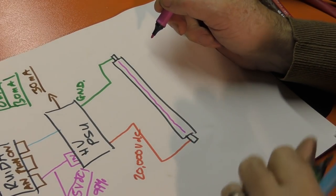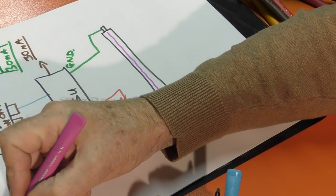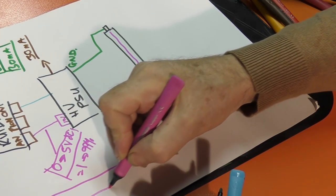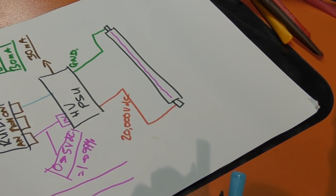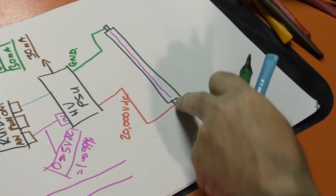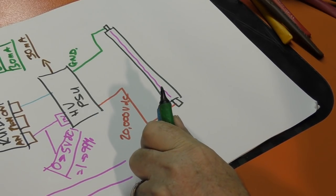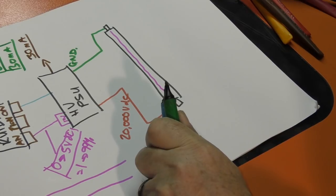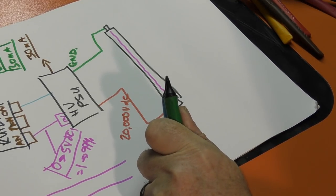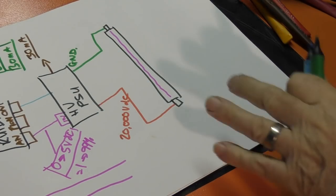Now, the problem is, if I've got a 5-volt signal, 0 to 5 volts, and I want 2.5 volts, then I'm outputting a 2.5-volt steady signal, which is 50% of the power, which is 15 milliamps to flow through the tube. With 20,000 volts switching on and off rapidly, we've got a hell of a lot of radio frequency interference that's pervading the whole of the environment around this machine.